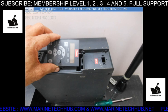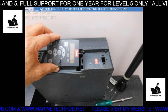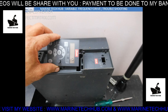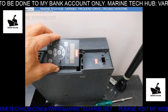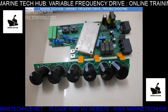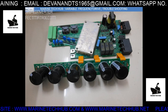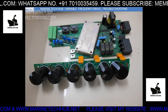Whenever demand is more — more people are using water — the pressure will drop. When the pressure drops, the Danfoss senses the pressure drop and increases the RPM. This is a continuous process, very important for multi-story buildings where there is no overhead tank. I'm also showing you how to repair the parts of the Danfoss. I've removed all of them — you can see the IGBT and the capacitor here. I'll be explaining all the parts in detail on how to repair them.